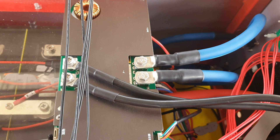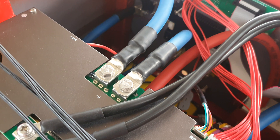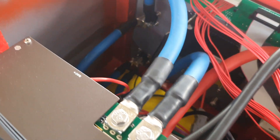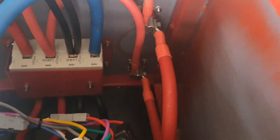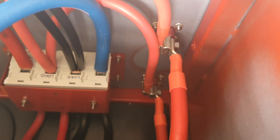Looking inside — you probably can't see much from this angle — but you'll see the negative side switching MOSFETs. Each one of those uses 35 mil cable. They're brought down and joined to two connectors, and then I've got another bridging connector between them for load sharing. Probably doesn't need it, but I thought, well, you only get one chance to do it.